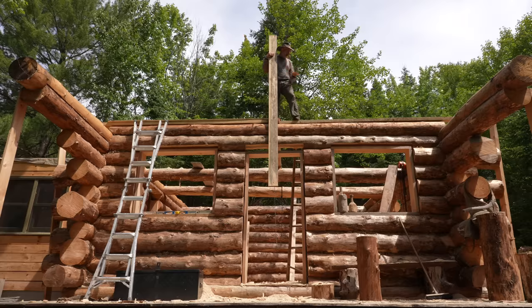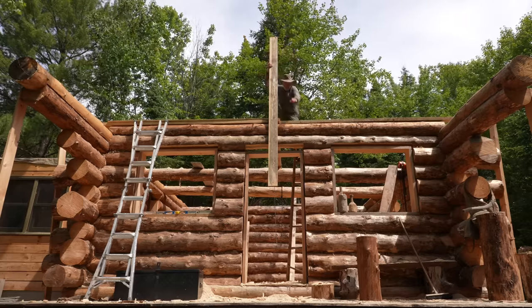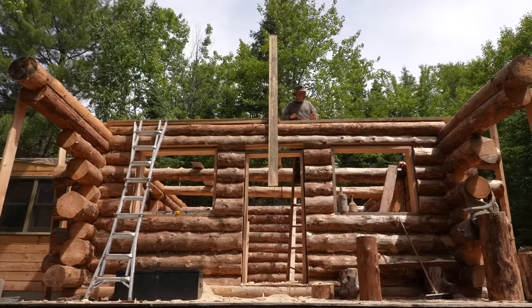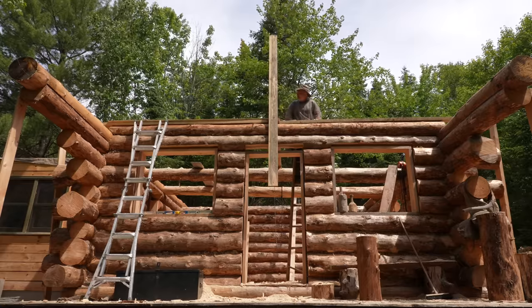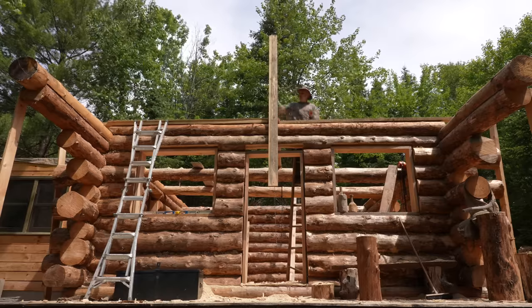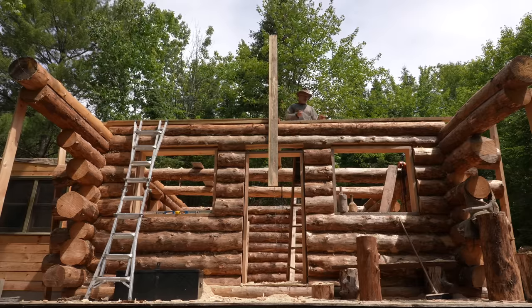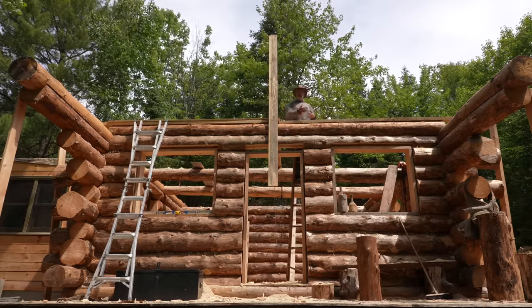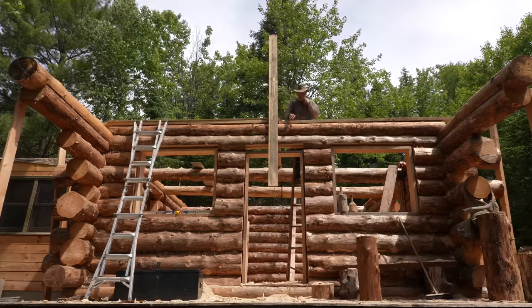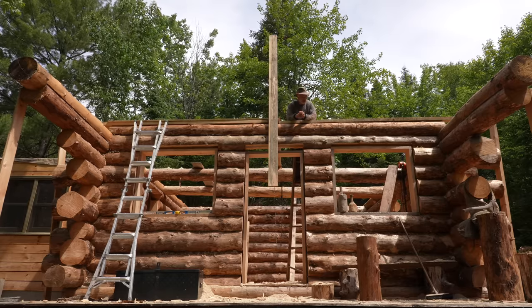So that's next. I'm going to plane this top log flat on top. So it's got about a 6-inch flat spot right here. And then, not sure if it'll be these or some longer ones, anyway, I'm going to frame that, so I'll have a log upright, a log upright, a log upright, and then I'll frame between those logs with 2x6 so that I can insulate this space. And then I'm probably going to do sort of a half log look, so I still get the full log gable end look, at least, without having the settling issues.